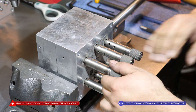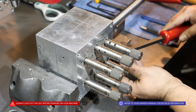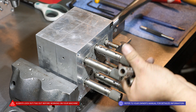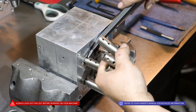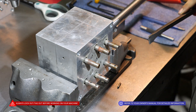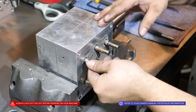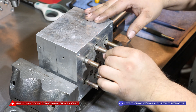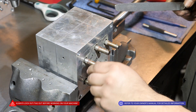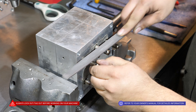At this point we'll need to remove these chucks. They can be a little seized, so what you do is use a pry bar and leverage against the vise or the gearbox. There's a burr around these holes that will interfere with removing the shafts and hit the bearings on the inside, so we'll need to deburr the holes so they can be removed easily.